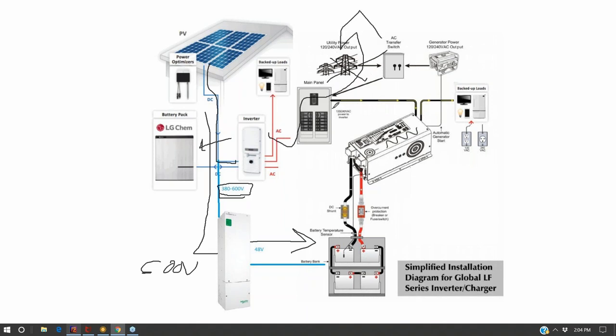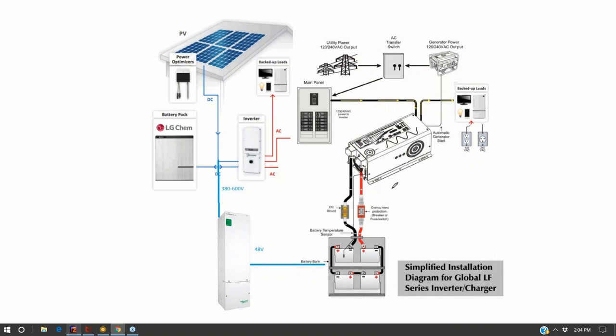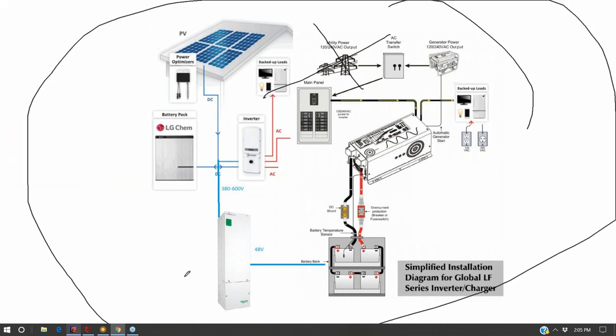And then when there's a power outage, we flick the switch and turn on our lead acid battery. At that time, we may or may not want to keep our SolarEdge inverter online. That would allow you to have your cake and eat it too, in terms of having a grid connection for backfeed and also having some backup power capability using cheaper stuff. What I think is also intriguing about that is, let's say you then said, well, my grid policy has changed and I don't want to keep my grid connection anymore, and I still have all this stuff.